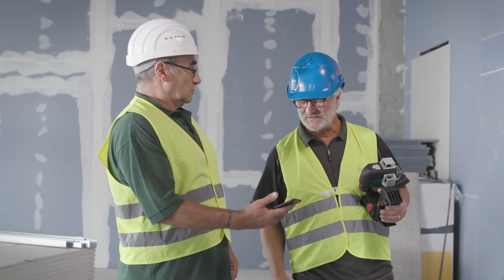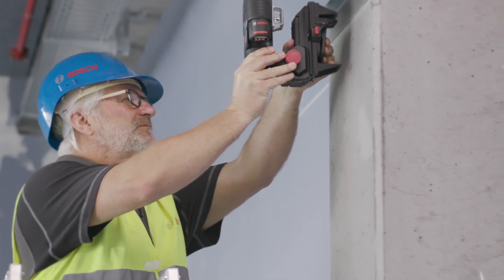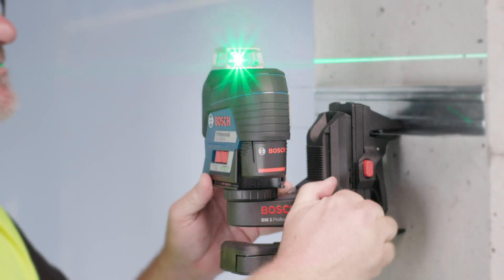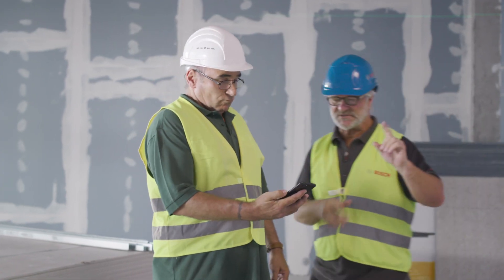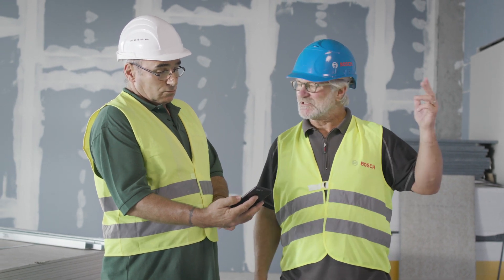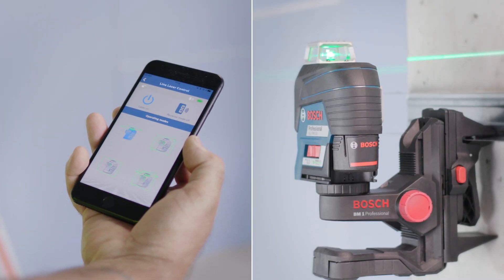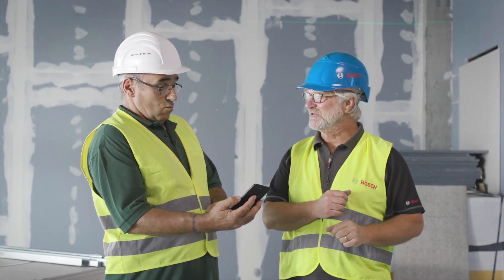Take my smartphone and I'll show you the leveling remote app. You just need a quick installation which is really easy. Then I activate the tool and the Bluetooth function, and I can see your markings and reference points here. Now you can see the response — the connection is established. Now imagine you go on a break or start on another job and don't need the laser anymore — just put it on standby. It preserves the battery and the laser but keeps the position. When you come back you can get right back to work. You'll see that the tool is reactivated, but the advantage is that you don't need to go back up the ladder and you won't accidentally move the tool again. You're on the safe side.